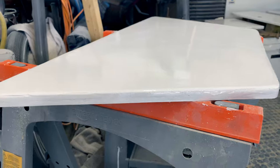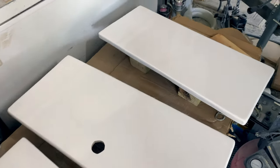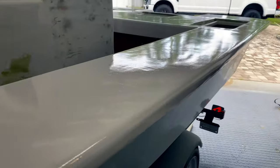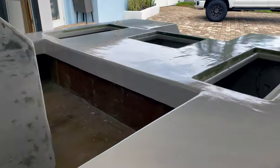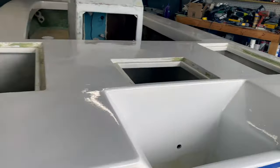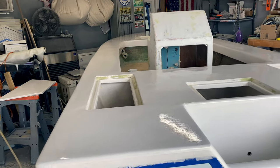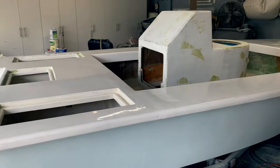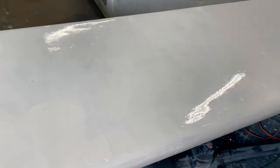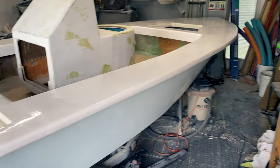As expected, that Alexseal just does its thing. I mixed eight ounces of paint, four ounces of converter, and three ounces of reducer - I didn't want to reduce too much - put in a capful of that rolling additive, and yeah it was so much it was actually too much paint. I did almost the entire boat twice, which makes me happy because by doing three coats this way - essentially five total coats on the top - it gives me a little build up so when I go to sand with 400 I'm not experiencing any burn through. For the first coat of white you can see there's a little burn through like before, but it's just so nice - that wet paint look.